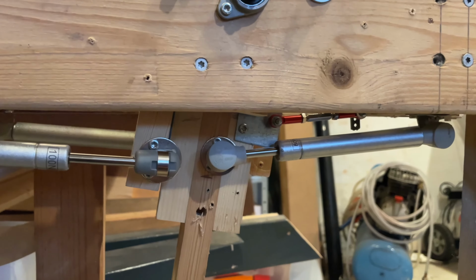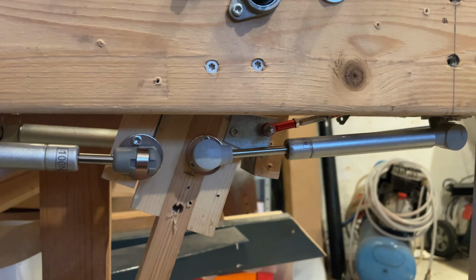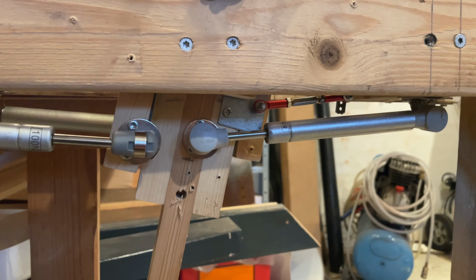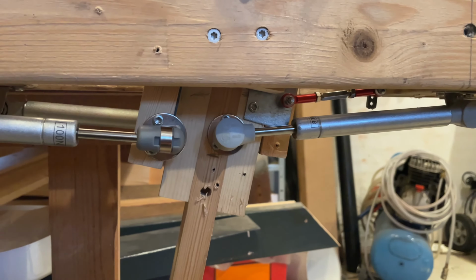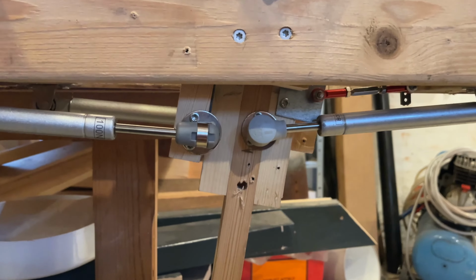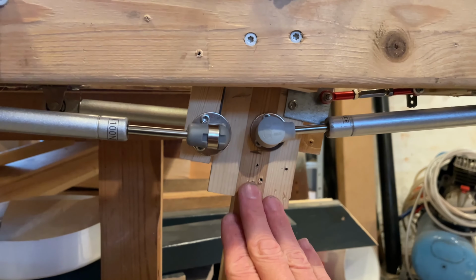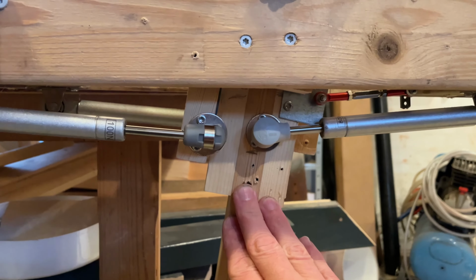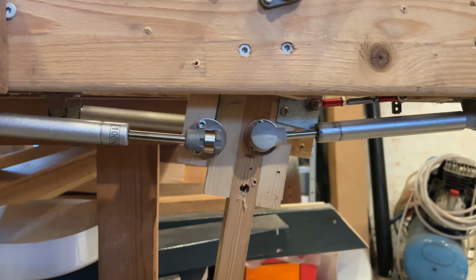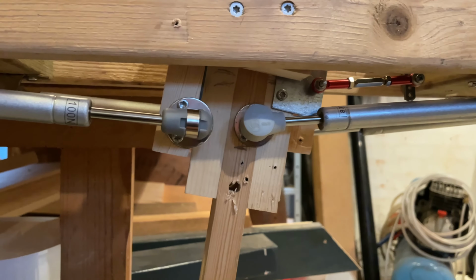But as you don't have that much, now watch from here, from this angle to the maximum, this angle, there's not a lot of room going on there. And having it not coming back to exactly 8 degrees, but perhaps here would be, let's say 11 degrees instead of there. That's 1/3 of the entire distance that this can travel. So the aircraft would think that your elevators would be 1/3 down. That wouldn't work. So I had to come up with something different, and I got inspiration from other people.